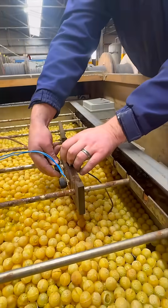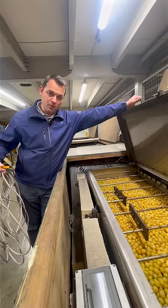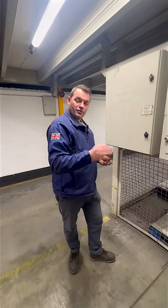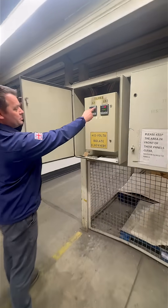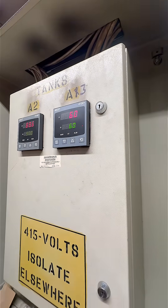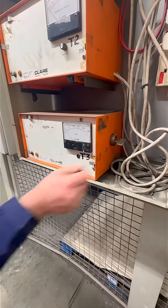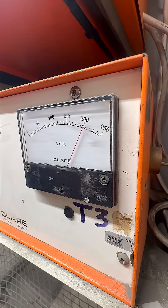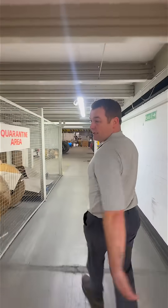We're doing the IR test for a long period of time, so this is testing water absorption — how much the cores will absorb water and whether the insulation resistance remains suitable. We're now going to set this running for the 10-day duration. Before that, we'll check the temperature of the water, which is controlled on these controllers. We're at 60 degrees Celsius in tank 3. We can power that up and it should go up to 200 volts and stay there.